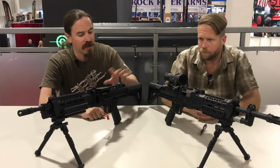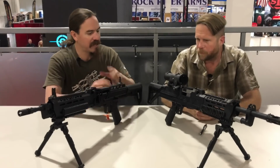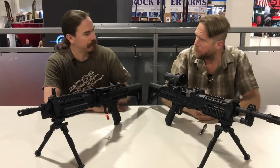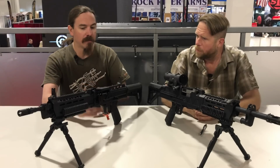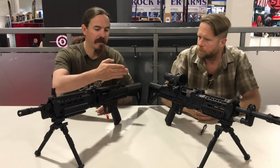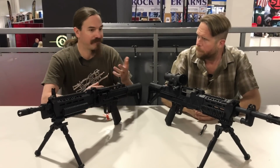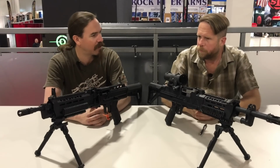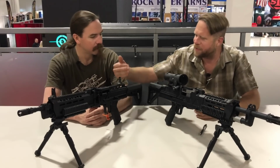The constant recoil system was, I think, Jim Sullivan who originally came up with the idea. You see it in his Ultimax. Exactly. And the Ultimax was one of the guns that inspired some of the elements of this, taking that constant recoil mechanism and using it. So the bolt cycles all the way to the rear and then stops on its own spring pressure without ever hitting the receiver, which means the gun just doesn't recoil harshly like most everything else does. You have a genuinely smoother impulse, although impulse isn't really the word because it isn't striking anything.